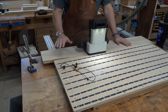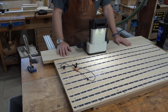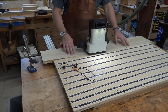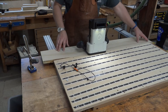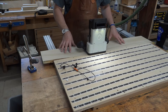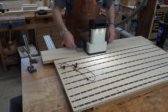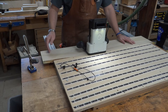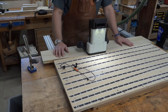For the center arch, I drew it out on Inkscape — it's a free drawing program you can get on the internet. It works very well to create scalable vector graphics. I drew an arch of the right dimensions and I have this piece of poplar. This edge is jointed and this edge is 90 degrees to this edge. I created a grid which allows me to import the file and place it precisely. I'm going to cut it down about an eighth of an inch and then go back, cut it close with a bandsaw and flush it with my router.